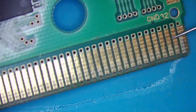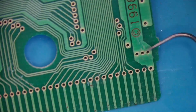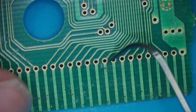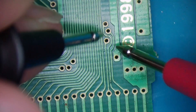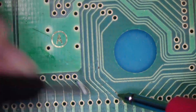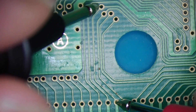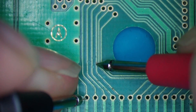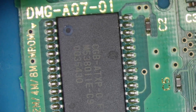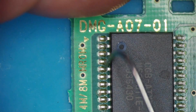Right, let's take a closer look. These don't look too bad. Ah here we go - some trace repair needed I think, perhaps one here, a couple over here. I'm not sure about this one - that should go through there so that should be okay. I'll check these four. That one's okay. That one's okay. This one is okay. This one - that's okay too, I would have bet your bottom dollar that was faulty. And that one - so if those are okay, I'm going to go back to a faulty pin. Yes - it's always that one. It's always the top one.